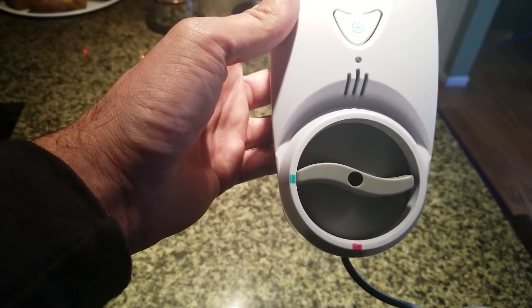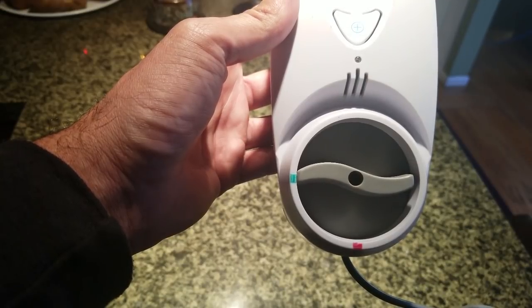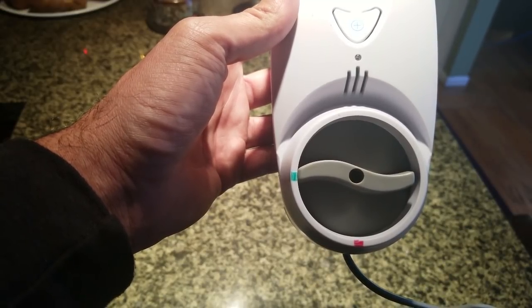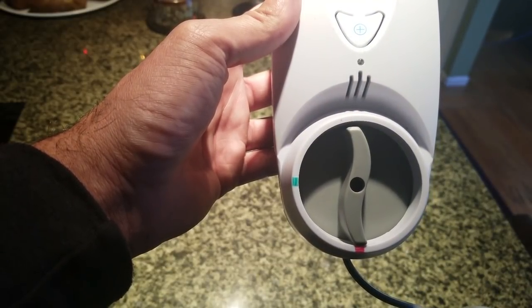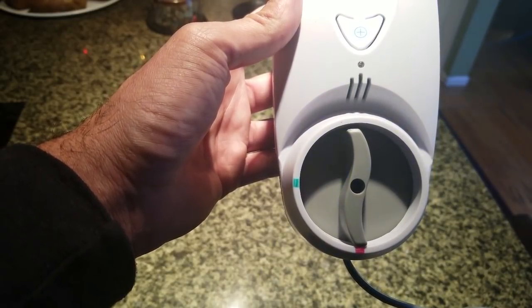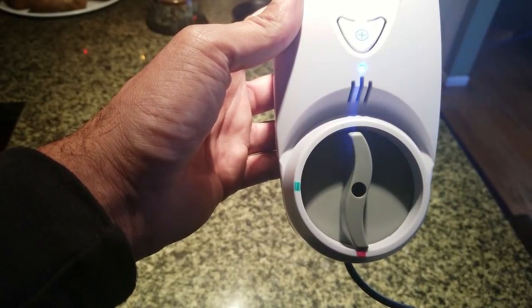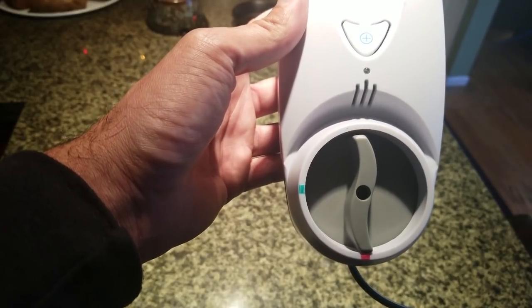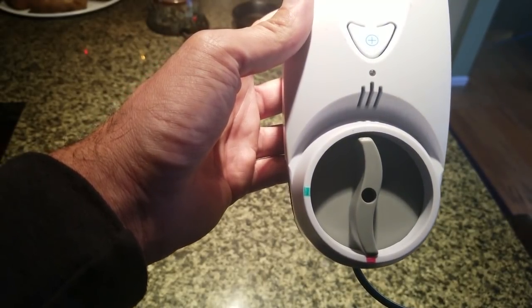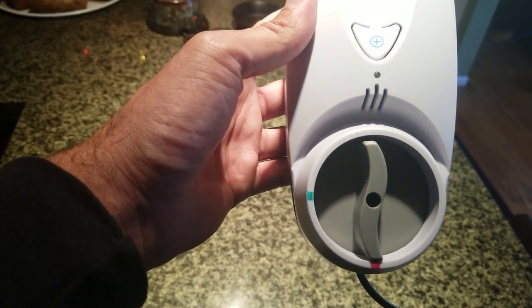Here I purposely wet the sensor to activate the controller. Wait a few seconds for the sensor to detect the water. The controller's dial should flip itself from the green horizontal position to the red vertical off position. You should hear the controller loudly snap like a mouse trap. The LED light on the controller should also be flashing a series of four flashes, and you should hear an audible alarm. Most importantly, the water should no longer be passing through the controller. The controller will remain in this state until you intervene.